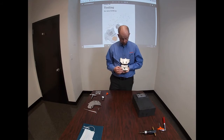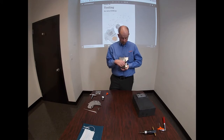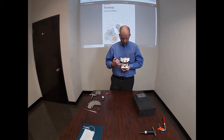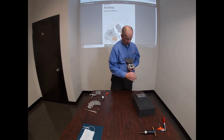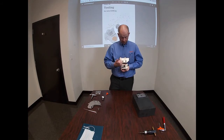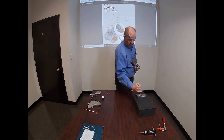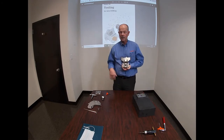The locking ring is kind of a misnomer. You'll notice that the drawbar floats in the back — we want the drawbar to float. We do not want the drawbar to have any influence on the repeatability and accuracy of the mating of the fixture to the chuck. We want the drawbar to do two things: draw these accurate references to these accurate references, and keep it there.